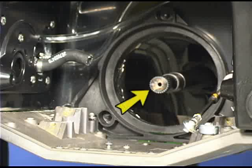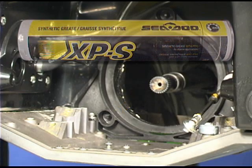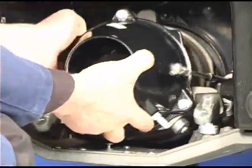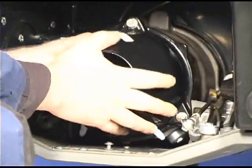To install the jet pump, lubricate the drive shaft splines, impeller splines, and the inside of the impeller boot with XPS synthetic grease. Hold the pump housing with the pump adapters downwards and align the pump with the drive shaft. Carefully push the pump into the pump support.